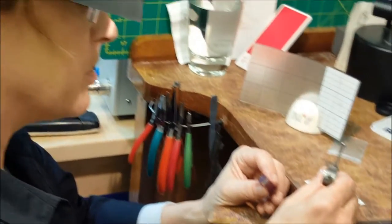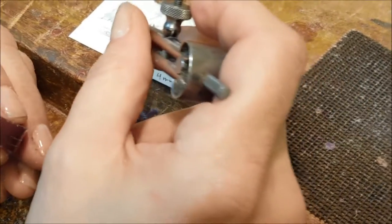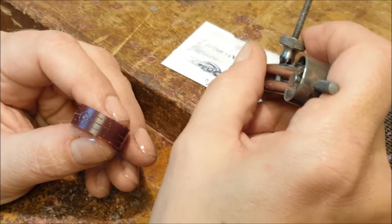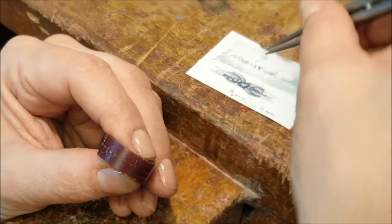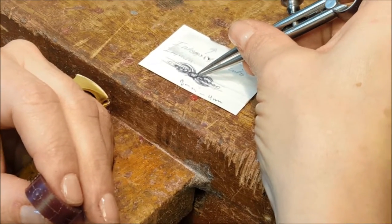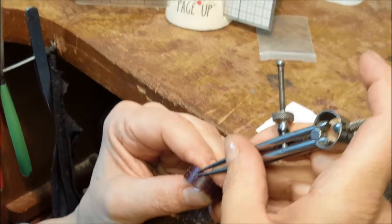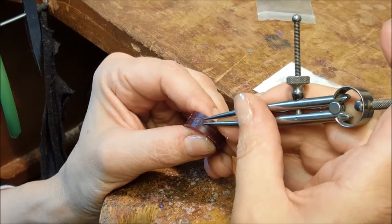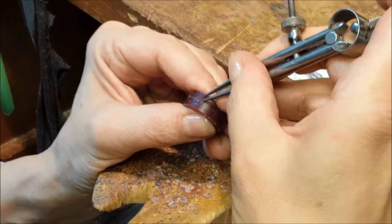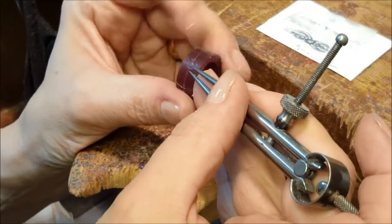Now I have to figure out how I'm going to do this little curve here, because it's not really round — it's kind of more oval and very S-shaped. It's tapered on one end and kind of full in the center. This is why I don't need to do math, because it works out pretty well if you just use your dividers. I'm going to use the center line as my reference point on that and just go off of it.